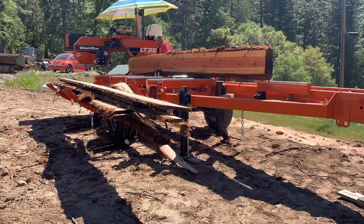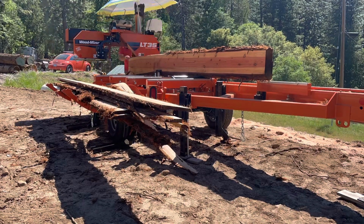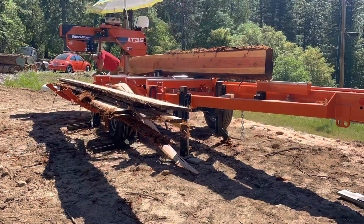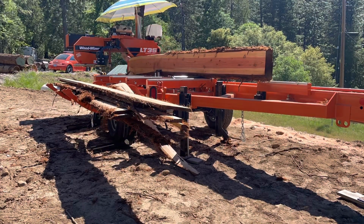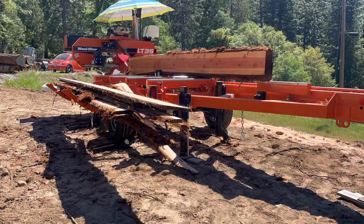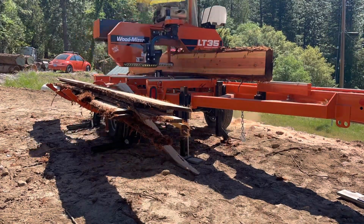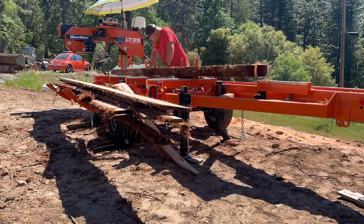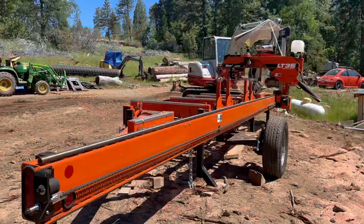I just pulled my ram down there so I have room to actually cut without cutting through steel. I take the mill all the way down the other end, and I verify that center on the mill measurements, and then I can set my mill up. I'm double checking, obviously. I set my mill up to the scale on it, and then take the slice. If all worked out perfectly, I would have 2 beams ready for the arch.